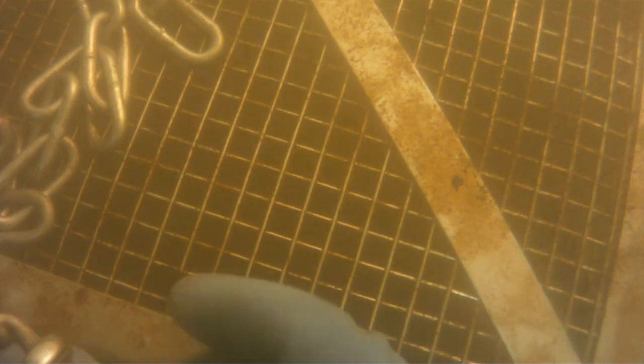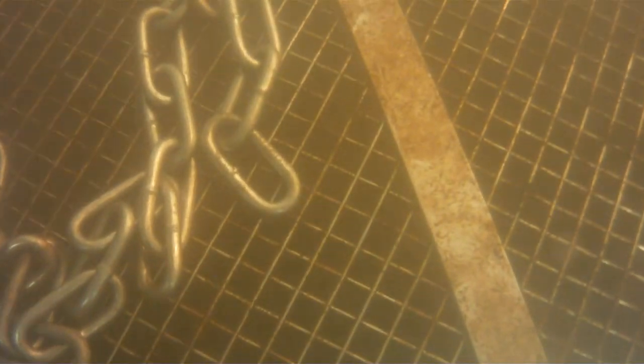And then when I put the secondary anchor shackle in the chain, what that does is if one side fails, then we have a backup. If the other side fails, then of course we have a backup. And then we're going to do it one more time to eliminate any extra chain from just kind of flopping around there, or we'll double secure it. So imagine that chain comes up, it loops through the link twice in different directions. We're going to secure it directly below that link, and then we'll take the excess chain, come all the way back down to the intake pipe itself, and we're going to secure it again at the bottom with another shackle or another little adjustable chain link there.